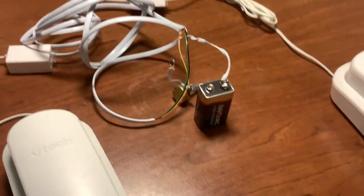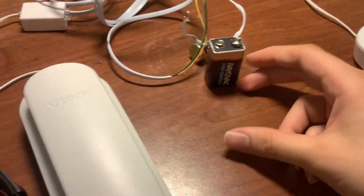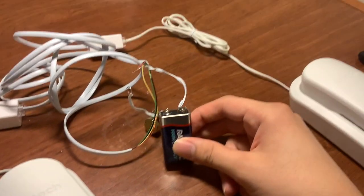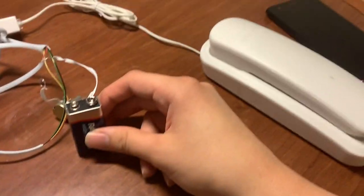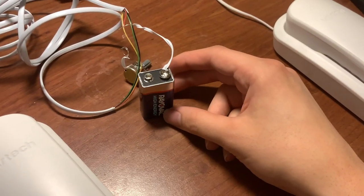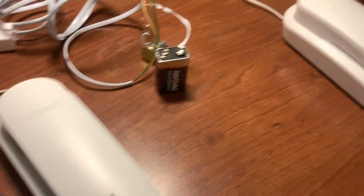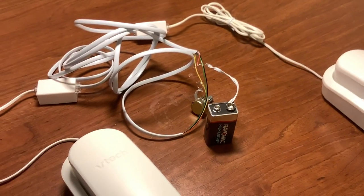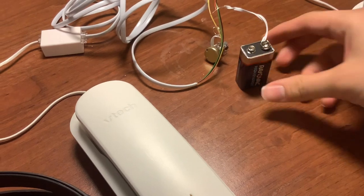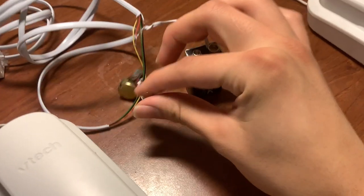In the middle we have to basically just energize the line, and that's achieved using this 9 volt battery. When you want to connect two phones together it's just a DC power supply — 9 volts in this case. You could also use different voltages depending on how long the line is. This is a short line so 9 volts is fine. We also have a potentiometer right here, connected as a variable resistor.